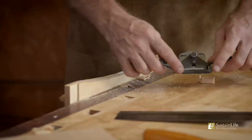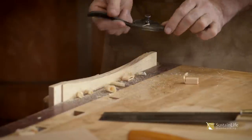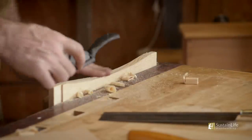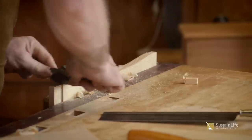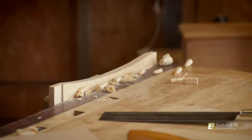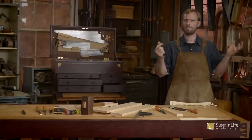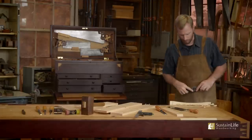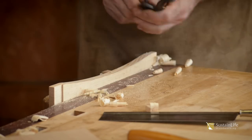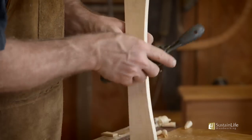Let's go ahead and start shaping this with the spokeshave. The way to hold it is one finger here, one finger there, your thumbs go right up at the top, and you can actually skew it like this. It's set a little aggressive, so I'm going to back the blade off just a little bit. I've got to work from the top down to the center and just smooth that curve right down. A great thing about a spokeshave is you can use it for fairing curves on a cabriole leg, shaping curves on a headboard, or even the back of a violin. You can also pull it towards you and use it for rounding the edges slightly, working from the top down to the center.